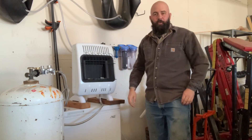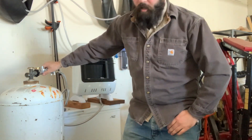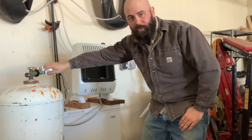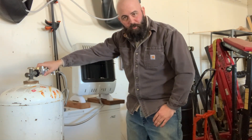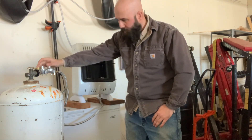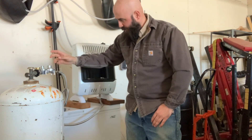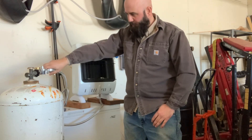So we have to acquire a regulator that will bring our inlet pressure from the tank down from at highest 300 PSI. We need a regulator that will go from 300 down to between that range. This regulator that I found can be found in the description to this video — you can buy one just like this and it'll go from 300 down to, I believe, 11 inch water column. It's definitely in that range.